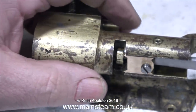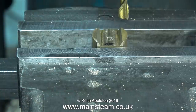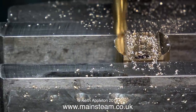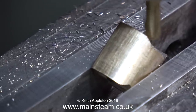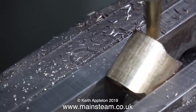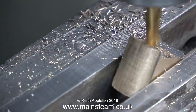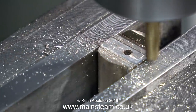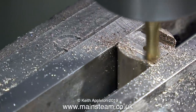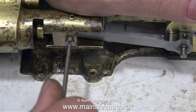I'm going to shorten and slightly reprofile this crosshead, so it's over to the milling machine to do that. You saw a very similar milling operation in the last episode, so I'm not going to dwell on it for too long. Here I'm milling the edges of the crosshead at the angles that I need — first one side and then the other. To finish the job I reposition the crosshead vertically in the machine vice and clean out the center. Machining things freehand like this does take a bit of practice, but eventually the job's done and it's time to put the engine back together and see whether it works.